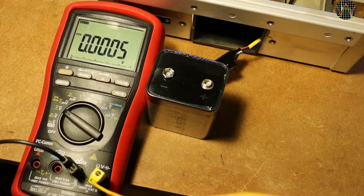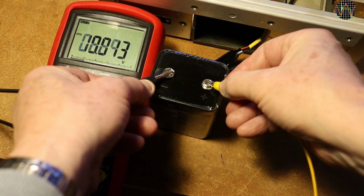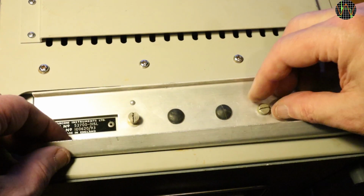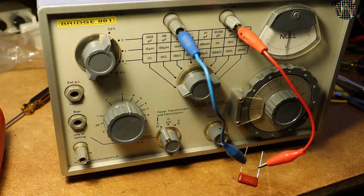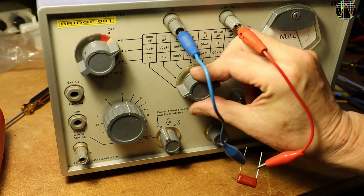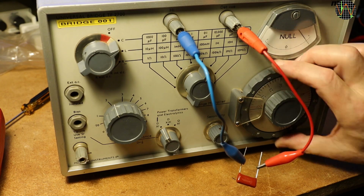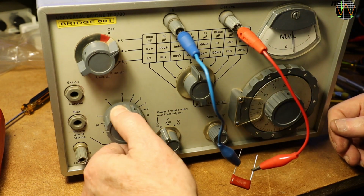Well, now I know. Given how hard it is to test after installation, how much voltage does a new PP9 battery have? Wow, over 10 volts. I put the enclosure back on and the new battery is in and connected, which means I can close the battery compartment too. Because of the possibility the contact resistance of the corroded terminals could have changed my previous test results, I decided to run the 100 nanofarad capacitor test again using the new battery and connectors. Spoiler alert, there was absolutely no change.